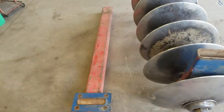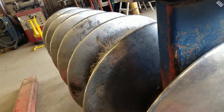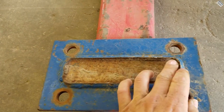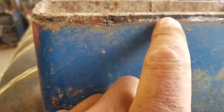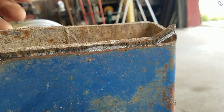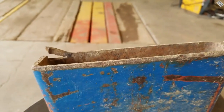I find this fascinating. This plate goes up on top of there and makes a mount for this disc gang here. But it popped off, and if you look, that bead is completely there — the bead separated from the metal here. On this side there's kind of a shiny spot, but I think that's actually from rubbing. It's shiny through there, and it's shiny right here — so that's all that was hanging on to it. On the other side, matter of fact all the way around, there's nothing shiny anywhere. This has been cracked for a very long time.